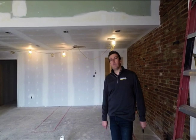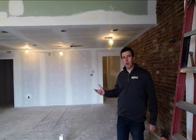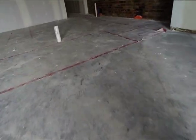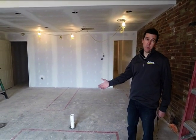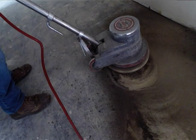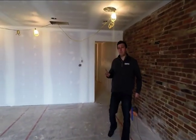So we're inside now. One of the first things we do is assess the condition of the floor — whether there's cracks or other coatings that have to be removed. In this particular case, there was some old glue on the floor that had to be removed. We did have it tested. It's not asbestos, so it's safe to be removed by means of grinding and sanding.